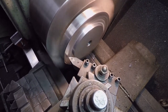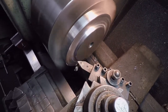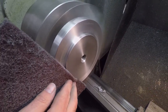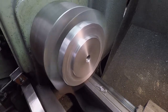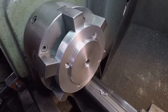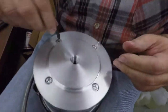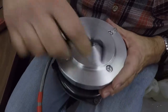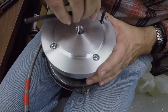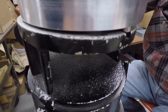Now the part was turned around so the opposite side edges could receive a chamfer as well. Bruce then used his pad of Scotch-Brite to clean up the remaining surfaces. The part gleamed — nicely done. The last step was to test mount the newly manufactured adapter to the rotor before it goes to be anodized. Each of the four M8 socket head cap screws were inserted and lightly tightened. The rotor was set on the Mitchell plate, indexing it using the M5 screw head.